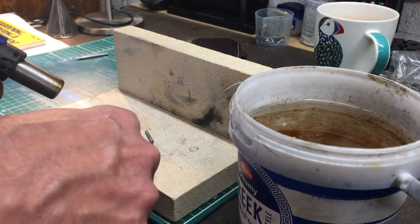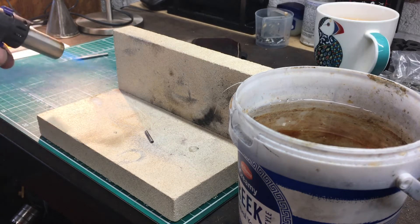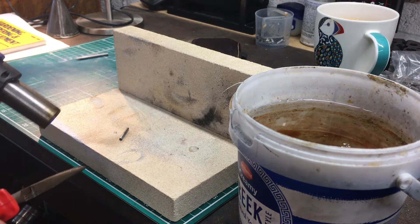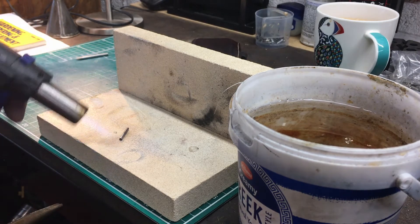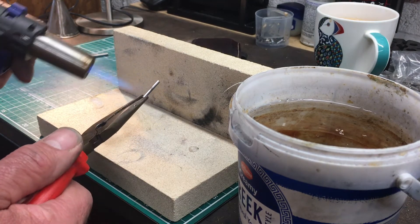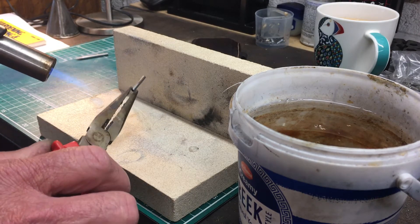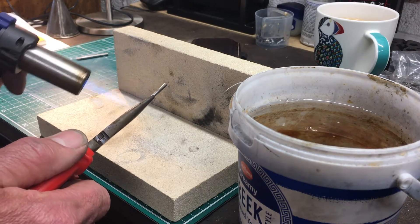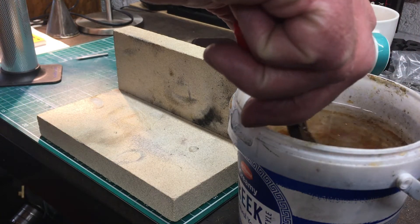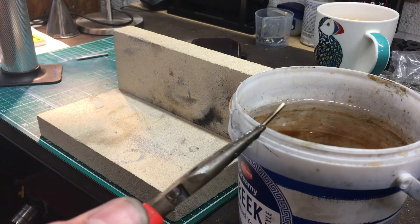The tool will be very hard but not very tough, so the job is to temper it. This is the way I've always done it — simply clean the oxide off and then heat it until what's known as the colours run. We're looking for a change in colour. Depending on what we're using the tool for, there's a colour which corresponds to the right temperature and thus the right degree of hardness. Here we have light straw at the top and dark at the bottom — it's all a bit imprecise to be honest, but it works.